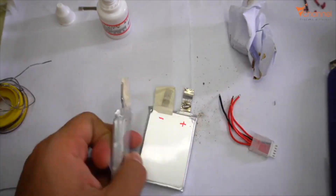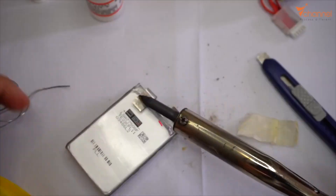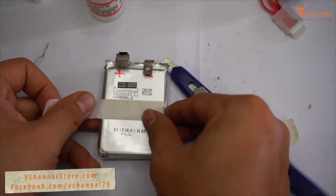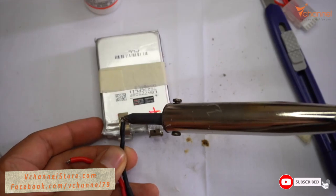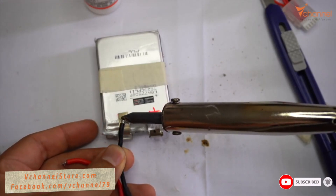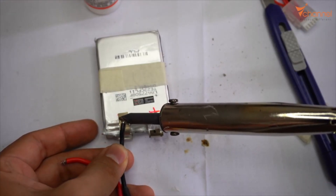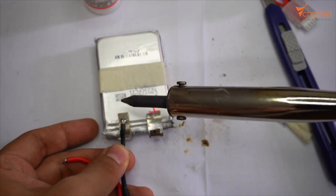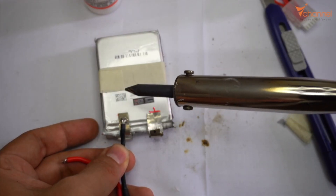The mechanism that recognizes battery replacement is this chip monitoring the voltage. When we pick the cell out and there is lost voltage or lost power supply, it will know that someone is interfering with the original battery cell and it will lock. If you can cleverly supply parallel power continuously when replacing the battery cell, it can cheat the chip.